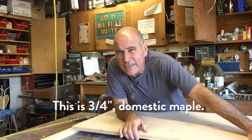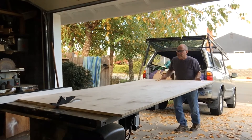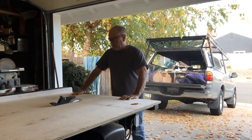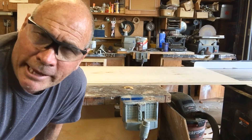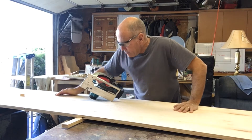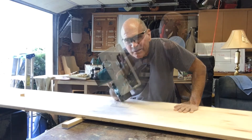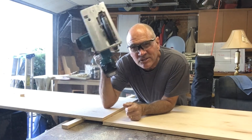If you've watched any of my previous videos, you know plywood is my cabinet making material of choice. I'm going to cut this piece 23 and a quarter inches wide, subtracting for the three-quarter-inch thickness of my face frame, so I'll end up with a 24-inch depth. The really nice thing about using plywood is you can handle it by yourself — it's not so heavy. I cut my bottom 41 and 3/8 inches. That's kind of difficult to do on my table saw because my fence doesn't go out that far, so I'm using this battery-powered Makita skill saw. I literally think you could build a whole cabinet with just this little guy.